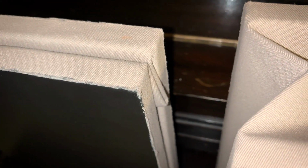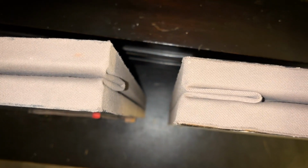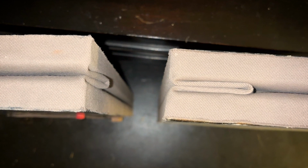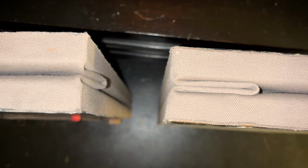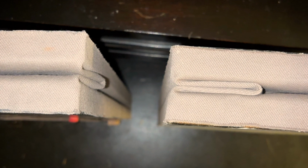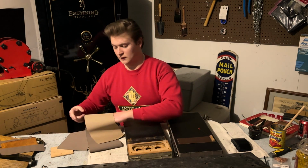Here I would like to mention that I did not notice until I was rebuilding the second exhauster bellows that my creases in the cloth of the first were inverted. Here on the left is the first exhauster bellows, which is complete. The one on the right is the second, which was about half complete at this point, and it was at this time that I realized my mistake. You can see on the left that the cloth folds outward, while on the right it folds inward towards the middle of the bellows. Functionally, I don't know that it makes a difference, but traditionally the correct way to fold or crease the cloth is as is shown on the right, and I was able to correct this in the first exhauster bellows. After the bellows itself is recovered, then the external hardware needs to be reattached.